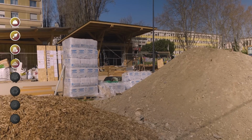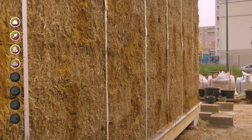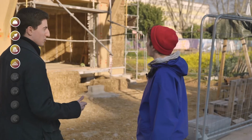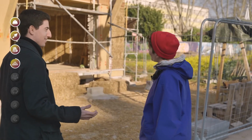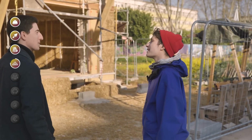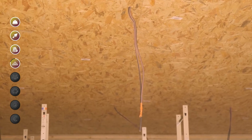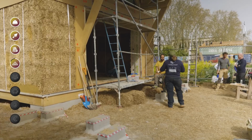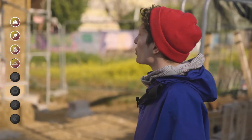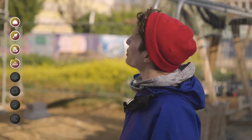So in the end you have insulation of the floor and roof with bio-based materials, in the high room and all around straw, so also bio-based. Very, very little structure, mainly wood. Ultimately, it's the ideal eco-friendly house. Yeah, there are still a few little panels floating around, but it's hard to do without panels. There is oriented strand board, and that oriented strand board is not good, ecologically speaking. It involves a lot more transportation. It's manufactured quite far away. So the panels, it's hard to do without them, but it would be nice if we could manage it one day.